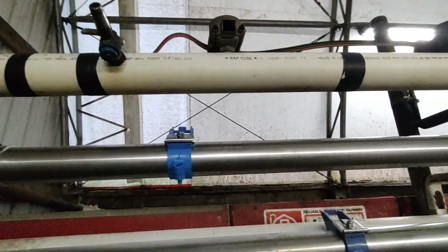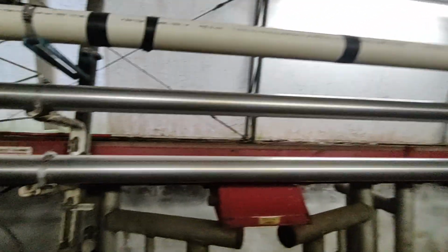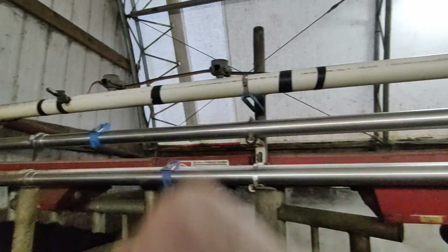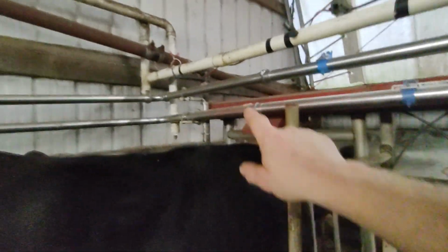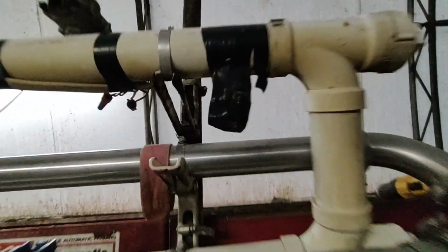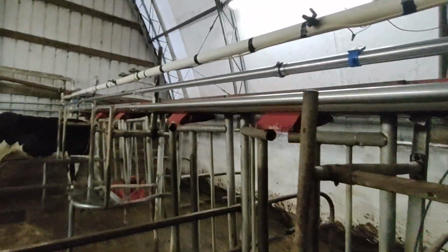And like I say, that would be a common spot where you should see something, but I don't see no sparking down through there. And that's the other thing. If one of these was screwing up, like say that third one was the one messing up, theoretically these two should be fine, and it should be affecting all them down there. But there is another wire that runs all the way down the length of this, and connects up there, and that makes it a loop.